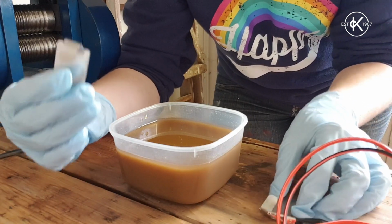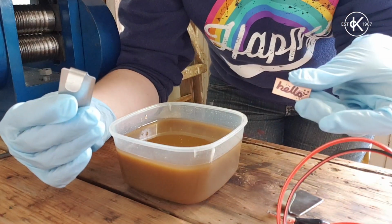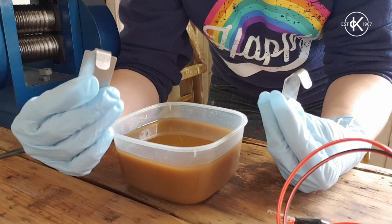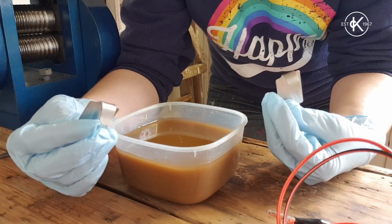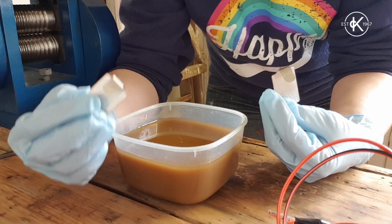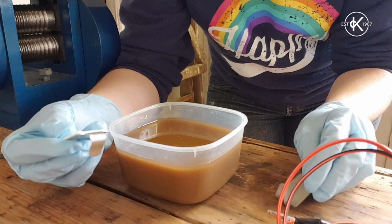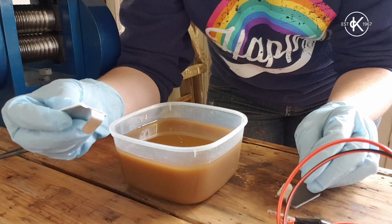So in theory, my anode and my cathode, if I'm etching copper, should be made from copper, but actually stainless steel seems to be a metal that you can use across the board. So no matter whether you're etching copper or brass or silver or aluminium, you can use a stainless steel anode and cathode, and I found these little stick-on hooks which are made from stainless steel.